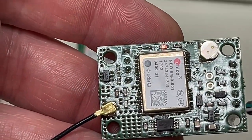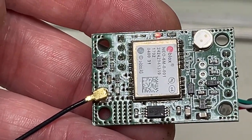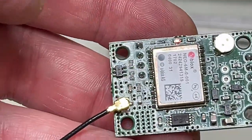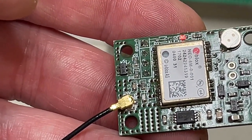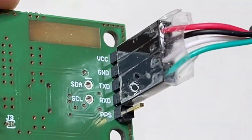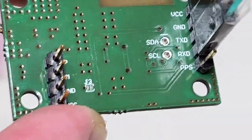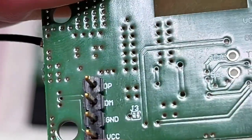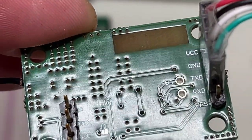The battery backup is only for a short period of time. Here it's a 6-series module — a uBlox Neo 6M — which uses an E2Prom. You can use them either through the serial interface, I2C interface, or the USB interface, or a combination. This is how I use them.